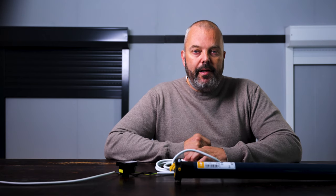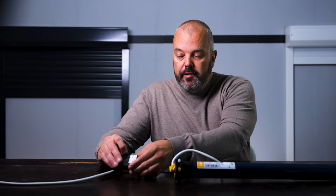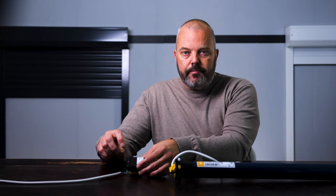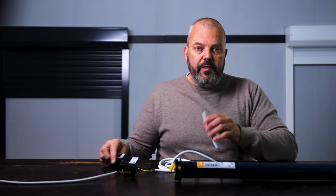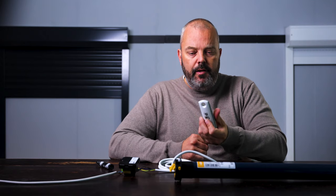So you can't use the program button on the back to remove it in the usual way. To start the removal procedure, first take the Centralis and press the program button until the motor responds — like that. Then press the program button on the back to remove this remote from the memory of the receiver module.